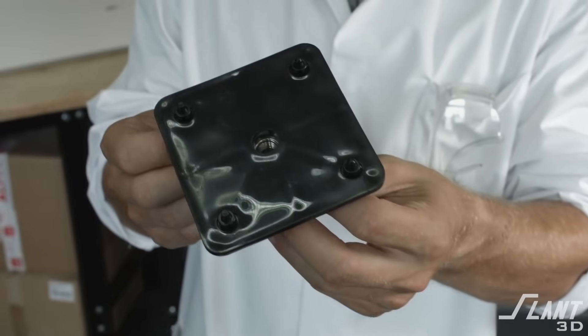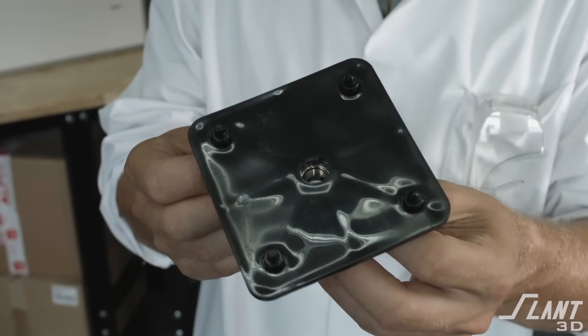The last really special feature is just how thick it is. This type of chunky, thick, heavy part cannot be made unless you're carving it out of a block of wood, which means you're wasting a ton of material. Whereas with 3D printing, you're able to make a thick, chunky, heavy part without waste and without having to worry about things like shrinkage, which make this type of piece impossible to mold because the sides would warp and shrink in if you were trying to shoot that much plastic into a mold.